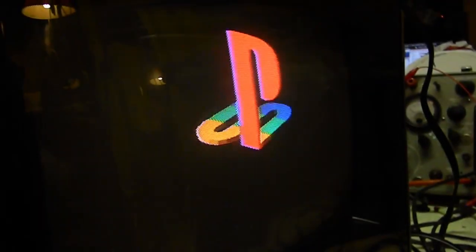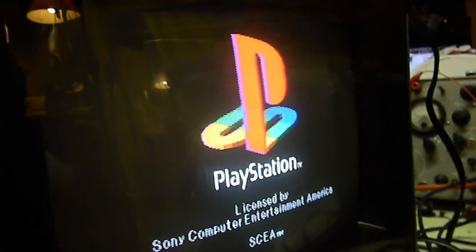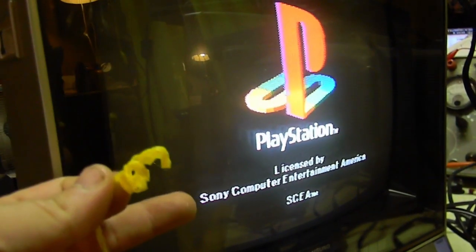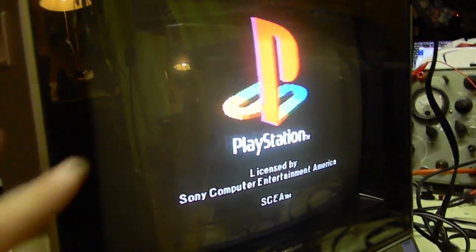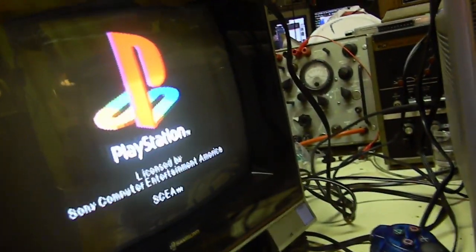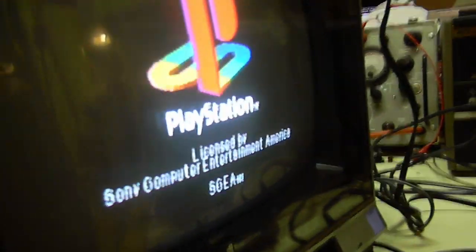By the way, I took the disc out during a loading screen so it would stay black, and then I bumped the brightness up just enough where I can barely see the black being illuminated, and then I adjusted it for all three phosphors being lit up the same. Then I backed it down to the point where I couldn't see it, closed the lid and let the game continue, and I was adjusting it off of colors I seen in the game. Oh, that looks good though.